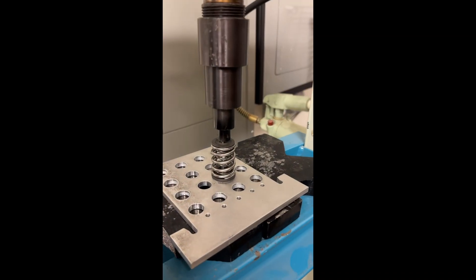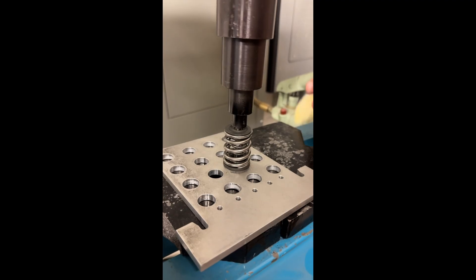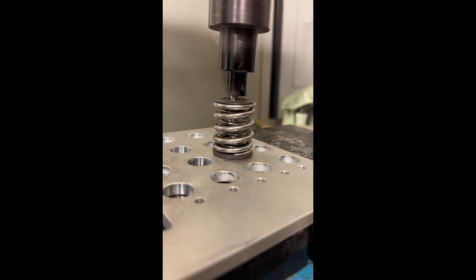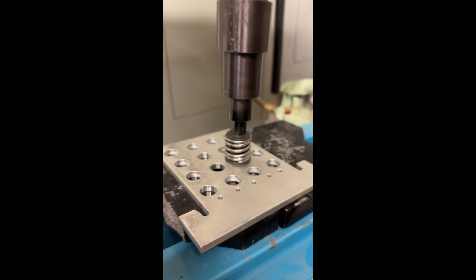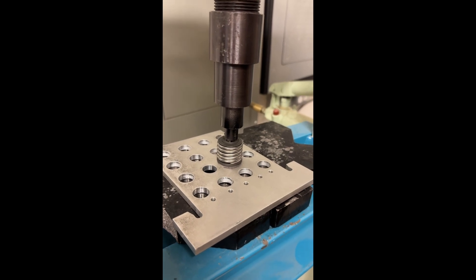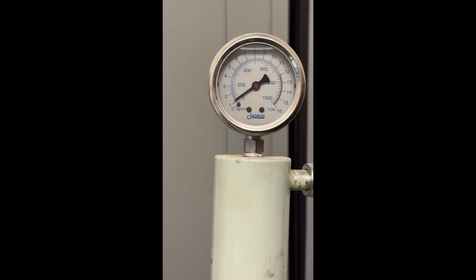Martin from Supertech and I were talking, and I said why don't you just put it in the press. We added a spring locator so the spring wouldn't go sideways - OEM spring, spring locator, retainer, OEM keepers, all triple glued. We're going to get the coil bind. Here we go - coil bind. There we go.